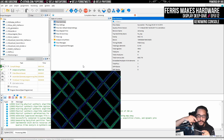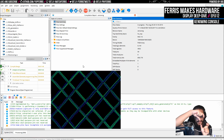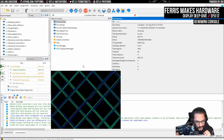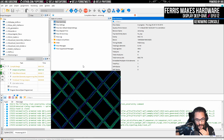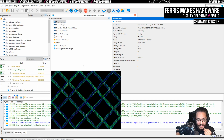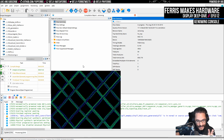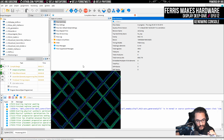Well, yeah, we could, because we could do reads on separate lines. So we do one read which reads these 2 texels, another which reads these 2 texels. As long as we can read enough bits per read port, then that would work out. So we could actually read all 4 texels in one cycle. And then after that, that's going to be one cycle of latency just to read that. And then because these memories aren't very fast, we'd probably have an additional cycle, maybe more, where we'd be able to do the blending.